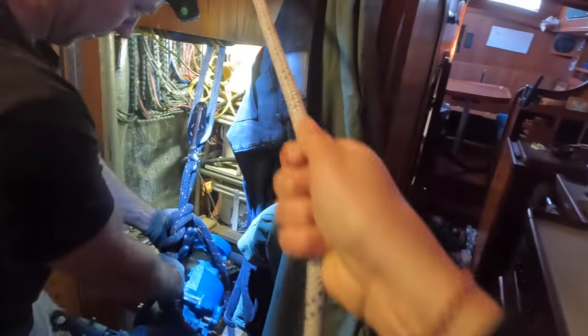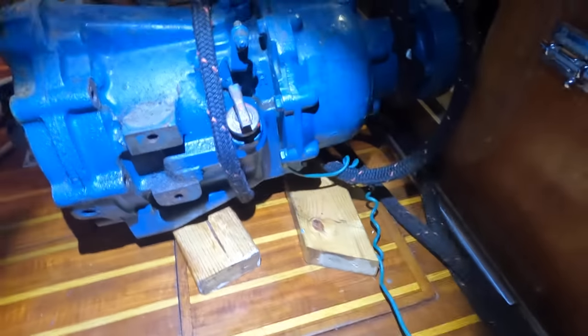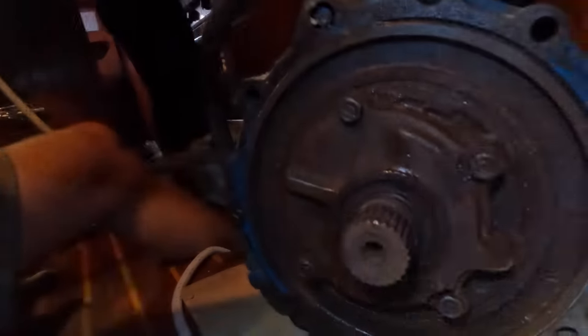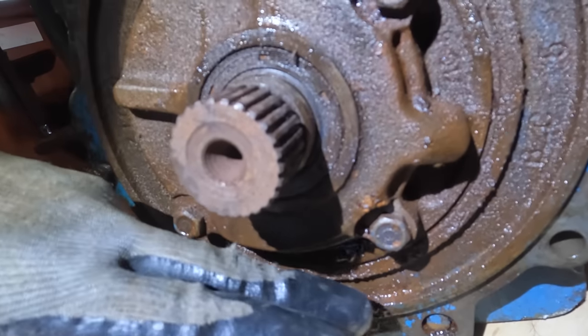Really, real slowly — let that down. All right, so we've got the gearbox out. I just need to verify that it's not the actual gearbox oil leaking out the seal here — I'm 99% sure. I'll put my light on. It's very wet but I don't know if that's just the splash from the actual rear main. We'll have a double check.